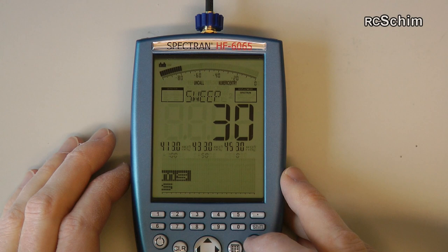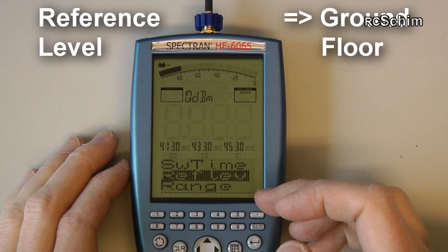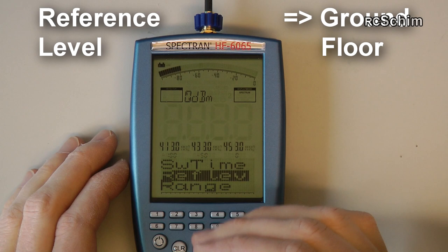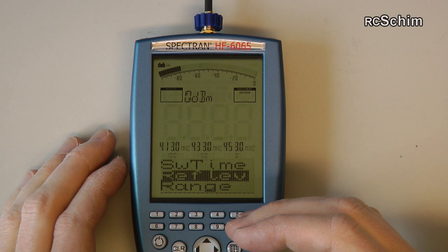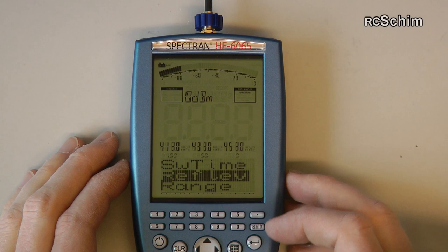That's the reference level. It's on the very bottom of your radio frequencies. You have a lot of noise, a lot of little waves going on, and you might wanna move up the level to eliminate all the unnecessary noise and just see the spikes of signals that's going on. But you can also move this with the cursor up and down later.